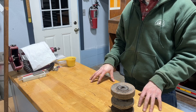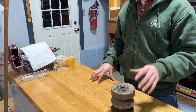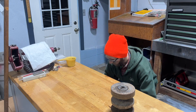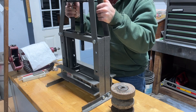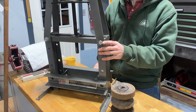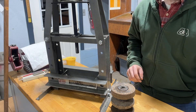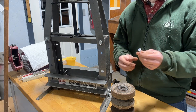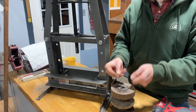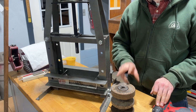I'm going to use as simple tools as possible. To rebuild this roller, I need to press out the bearings and seals in some way. I'm going to use as simple of a press as possible — this is a poor man's hydraulic press from Harbor Freight, which will be used to press the bearings in and out. When it comes to the seals, I may not need that much force, so I have a poor man's seal puller, which is simply a screw. I'm going to try screwing these screws into the face of the seals and then pulling on them to remove the seals.